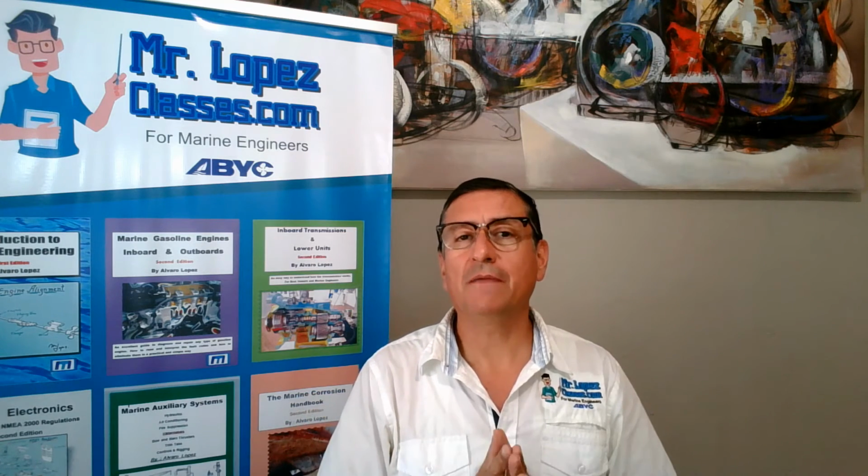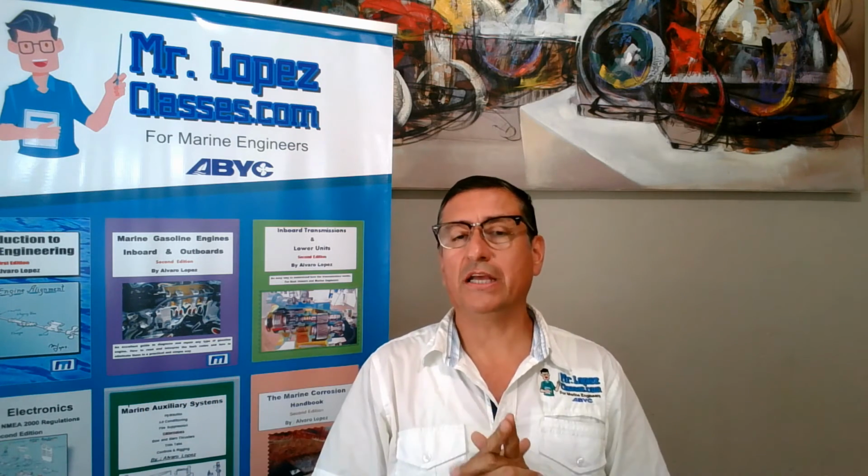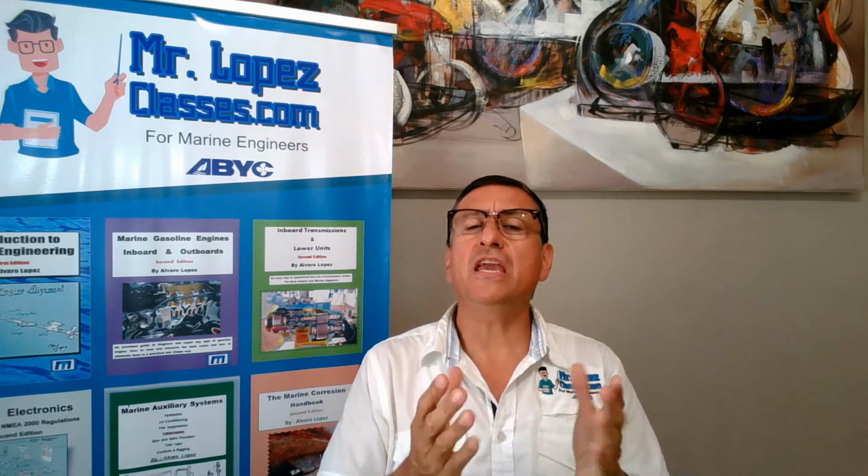That's not good. Be careful, never use the bonding conductor like a ground to connect equipment. That's not accepted. If my bonding is good, my bonding can help during the storms to drain excessive amounts of current.